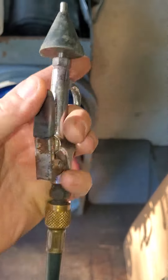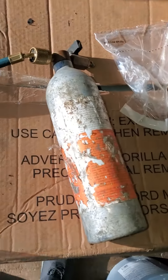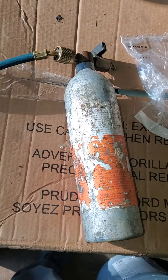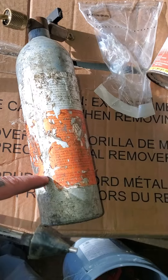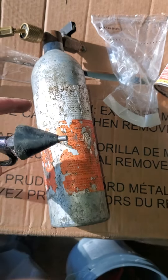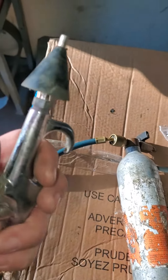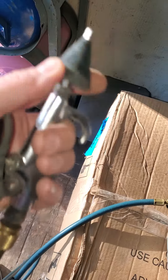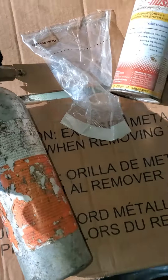Typically we pull an evacuation on the unit after we pressure test it and cycle nitrogen through there. I'm assuming I could use this kit to fill it with some kind of cleaning solvent — like parts cleaner. It probably doesn't take much per system, maybe a few ounces — not necessarily fill the bottle, maybe half the bottle. I can just send this through the lines, one end with a rubber stopper into my female AN fitting and out the other end into a bucket.